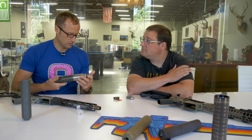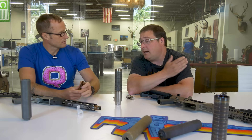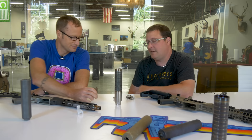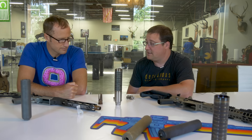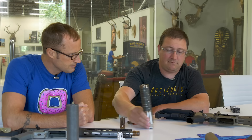Because this is a stainless steel blast chamber — is it as important with respect to erosion to make a giant cherry bomb for this? The cherry bomb's main purpose is to provide recoil reduction when the silencer's not on. Because the Fix is a very light gun, we had to spend some time to get that recoil reduction just so it's not terrible to shoot. It's a six-pound 308 gun with a real small butt pad — it gets old, especially before you had the big butt pad.